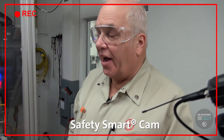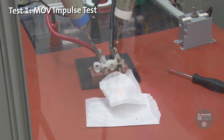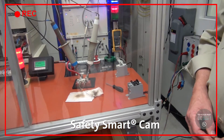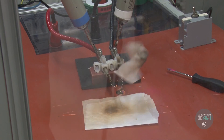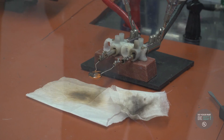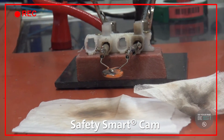Right now, we're applying an impulse of about 6,000 volts, 3,000 amperes to this product to see how it reacts. The energy contained within the impulse was more than what this was designed for. They normally would not react like this, and now you know the limitations of this particular product. It's all for safety. Thank you very much, Ed.